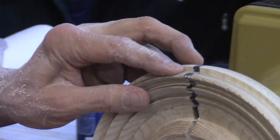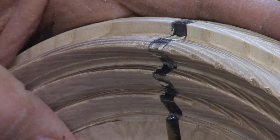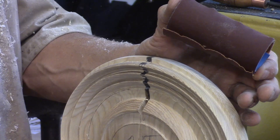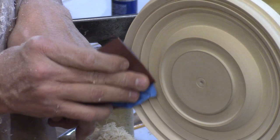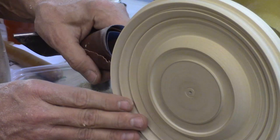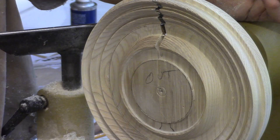So now I would normally take a little sandpaper — just probably 220 — and knock down the tips of these branches. These are reader glasses, they work great right here. Knock down the tips of these branches to kind of get rid of some of that tear-out and just make them a little less sharp. I wouldn't spend a lot of time at it, because even with a little bit of tear-out, once you cut it thin, you're not going to notice much. And these are just little trinkets anyway, so not too picky about them.